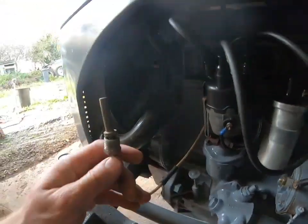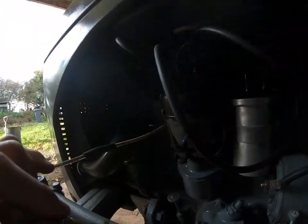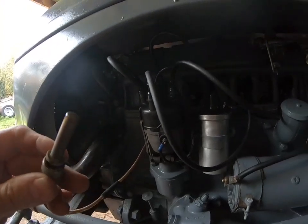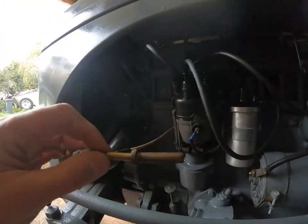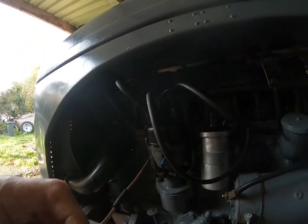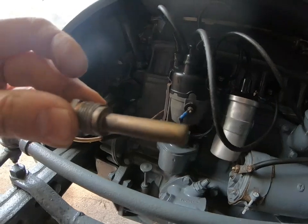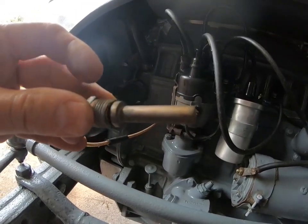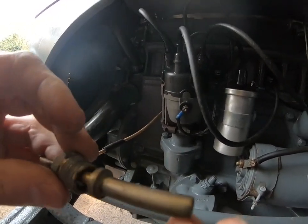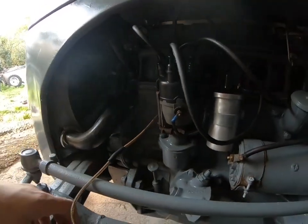temperature gauge. I fitted the temperature gauge, I screwed it in the other day, but it started to leak, and if you see, there's no seal whatsoever around that. And if it isn't a tight fit, which it probably isn't that good, it leaks. So what I shall do in a bit is get some gasket sealant and put it on there and do it up like that, because when it's pushed together like so, there's got to be something there to absorb it, a bit of gasket or a seal of some sort between the two metals, because water leaks anywhere, doesn't it?